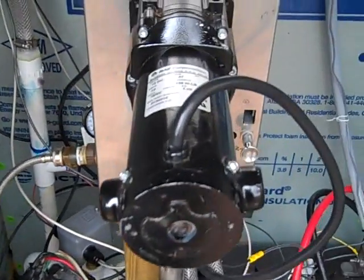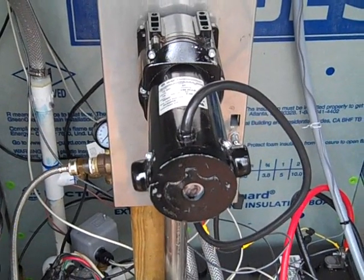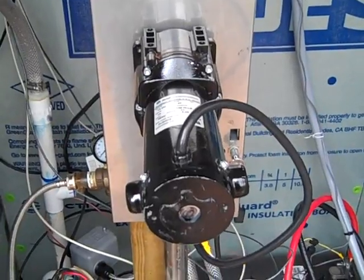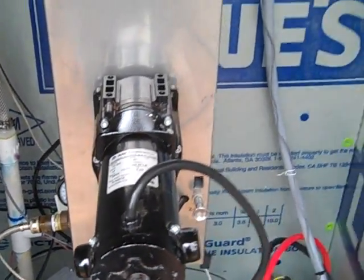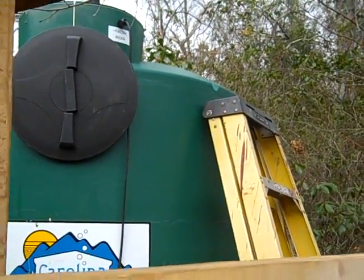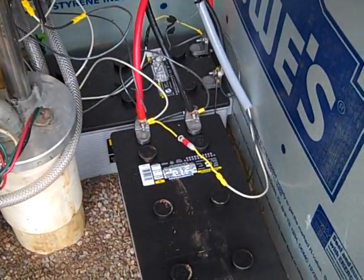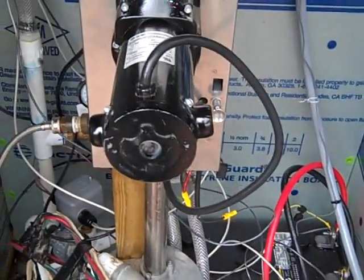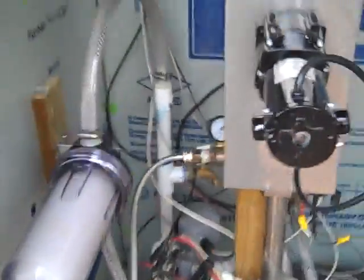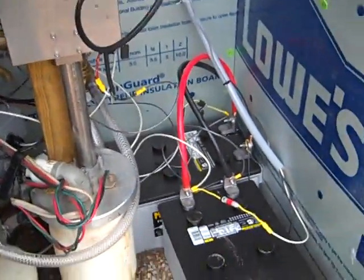You can do it all with one shot with a simple pump, but it's a lot of work and sometimes on demand you don't have all the water you want if the sun's not shining. It's cheaper to store water than it is to store electricity. So when the sun's shining, we pump water, fill that tank, and then boost it off of the Flowlight pump.